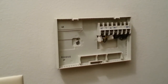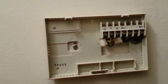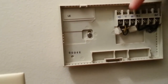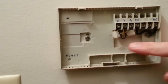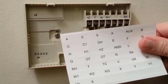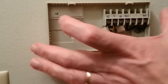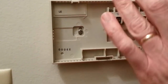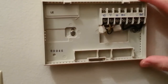Here's the important part — this wiring. You're going to need to match that to the newer unit. There are markings here: G, Y, W, R, H, B, O, R, C. They'll give you little stickers with those letters on them. You want to attach those letters to the wiring so that when you remove this plate and put on the new one, you can match them back in and your system will work. If you don't do that, you're just asking for a lot of trouble.